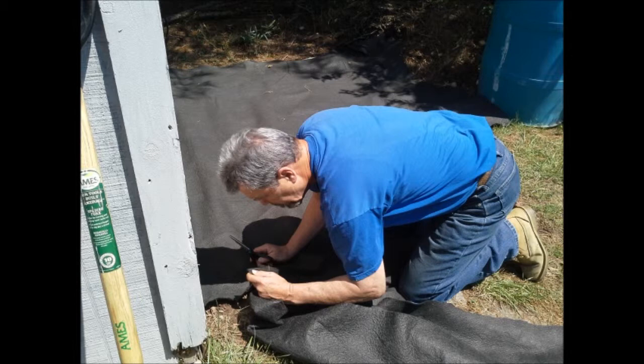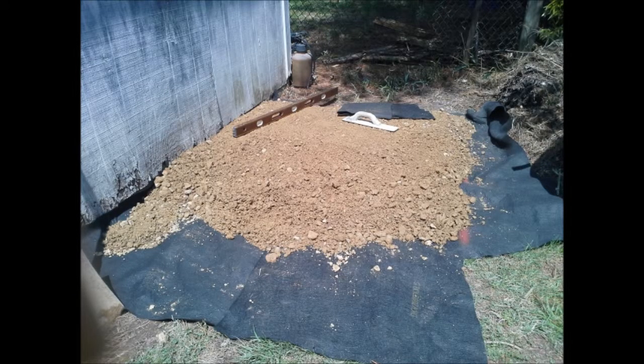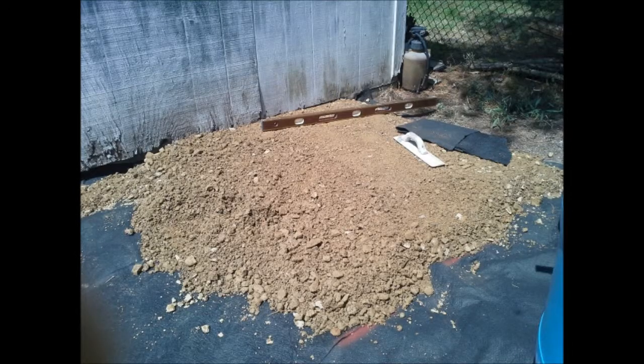He cleaned them out as best as he could to remove anything that was inside, covered them with fabric, and then put them back in their respective crates. After covering the tanks, he built a platform for them behind the shed, which was going to be the collection point. He first covered the ground with plastic and landscape fabric, and then put up a wooden frame, which he filled with clear and modified stone, and then put a layer of screenings on top.